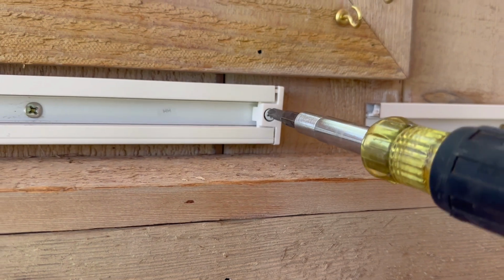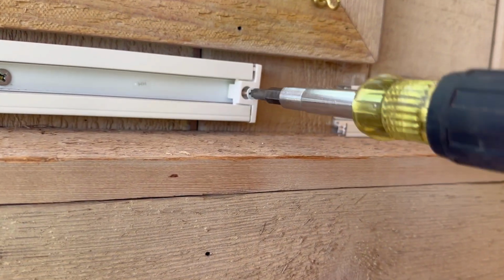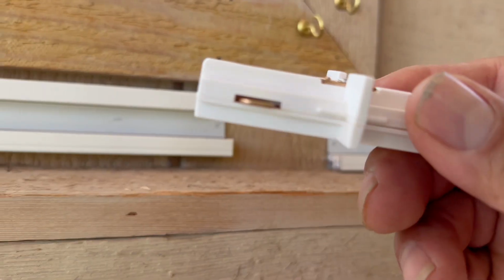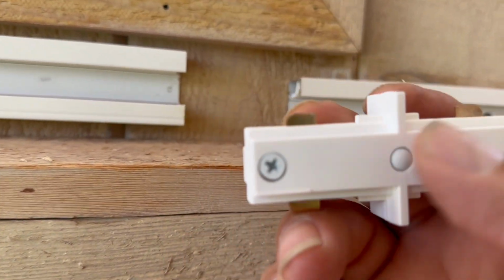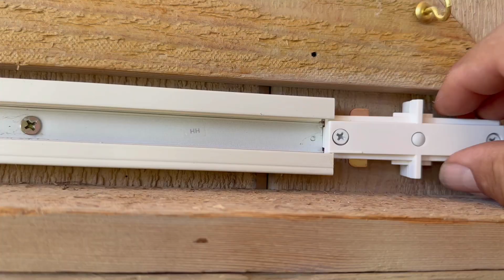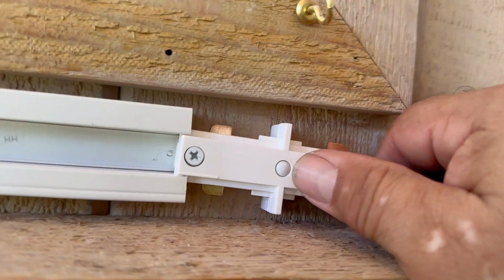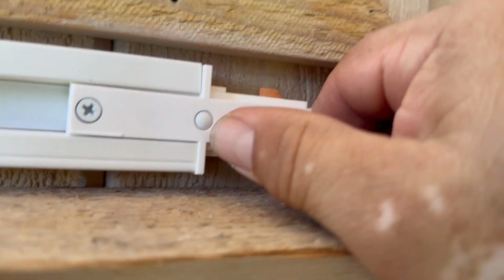Now notice that this track has the end cap. You're always gonna push the new track with the end cap on. Since this is the one we just installed, we're gonna remove it, and then we're gonna put two tracks together with this coupler. Now pay attention to the direction, as some of the tracks have two conductors at the bottom, so make sure that this coupler, the two conductors are at the bottom. We're gonna push it,